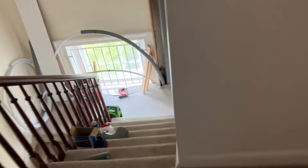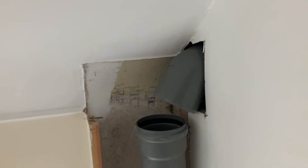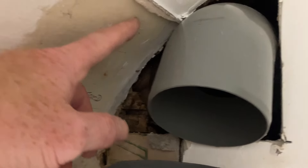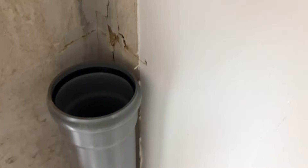I'm just going to keep drilling the hole downstairs, then I can attach all these bits. I don't want to connect them all up yet because it might be easier to connect from the bottom and bring it up to connect at the top, rather than fix the top and have the pipe in the right place but not be able to move it at the bottom. We've still got the hot and cold feeds coming up — I've just moved them out of the way. Where the pipe is coming out I'm going to take a bit out to get it as far over as possible, because we need a 50 mil waste pipe coming down and bossing into the soil pipe. The waste will go down — that'll be for the shower and the sink.